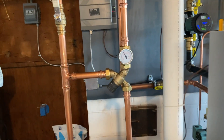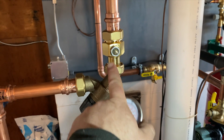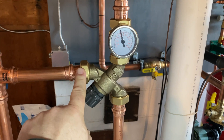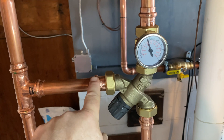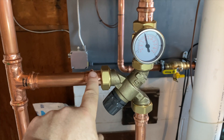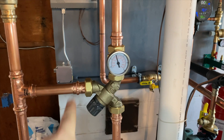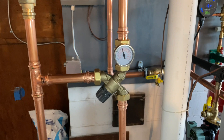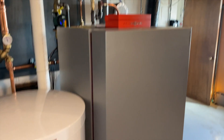I use this Caleffi angle mix valve — it's a personal preference. It comes with a temperature well right on the outlet, press unions, and G-type unions so I can put any kind of piping connection on it: iron pipe thread, PEX-A, PEX-B, sweat, or press — whatever I want. I buy the valve body itself and add the connections on.